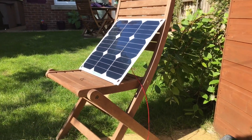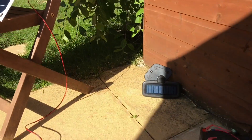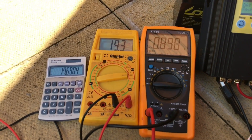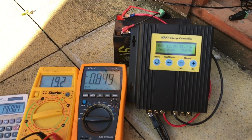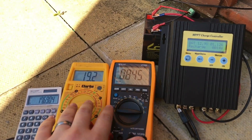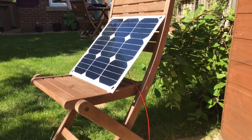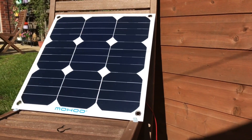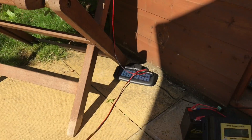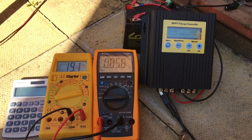From a claimed 30-watt panel, I'm afraid today I just can't get the 30 watts out of it. Despite my best efforts — using MPPT and tracking that sun as best I can using this chair — it's just 17 and a half watts on average. So there we have the Mohoo semi-flexible SunPower solar panel, which sadly, at least today, can't quite live up to its 30-watt claim.